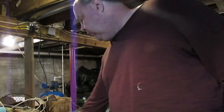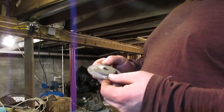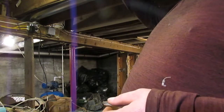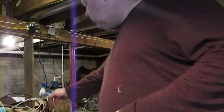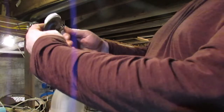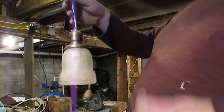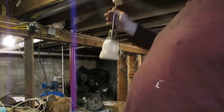So this cover that I just showed you was an example of what they would mount typically in a basement. They would mount a 3-inch box on a beam, and they would use a light fixture similar to this with a flex cord on it. They would pass the flex cord into there, and of course you'd tie a knot into that and it would hold the light up like this, and then they'd wire it into the system and you'd have a hanging light fixture like that.